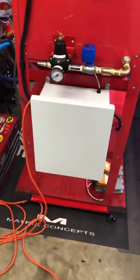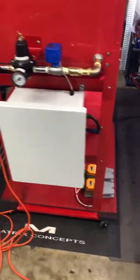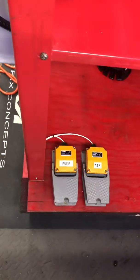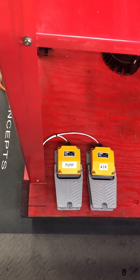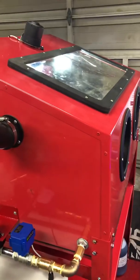That is a huge control cabinet — it's got DC power supplies and terminal strips, and that's where everything happens in terms of the relays. There are also latching relays in there that work with these pedals down here, because these are non-latching pedals but those relays make them work. I've got a pedal for the pump and a pedal for the air.